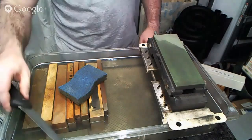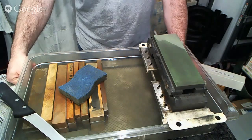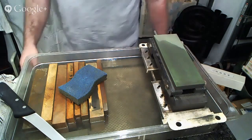On lower grit stones, having pressure both ways is totally fine. On single bevel knives, you'll notice that you get a little bit more consistent results with the pressure on the edge trailing stroke. With the exception of Uraoshi sharpening, let's find a single bevel knife real quick so I can explain this.